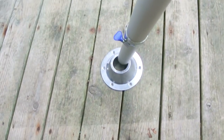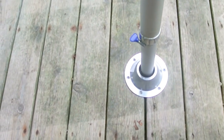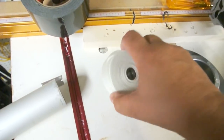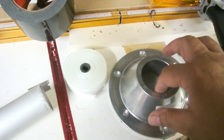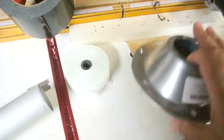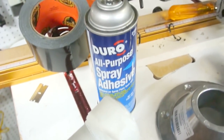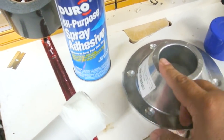What I'm going to do is set this in like that, and then pour epoxy around it — the epoxy should hold that really well. I have some fiberglass cloth that I'm going to wrap this in and get it to the diameter of this, and then it'll make a snug fit. I put duct tape on the bottom so it doesn't leak through. I found that using a little bit of spray adhesive helps hold it together, so now we're going to twist that into here.